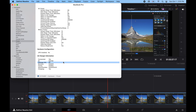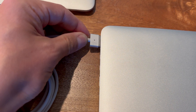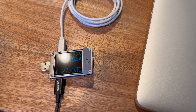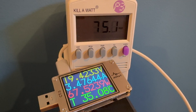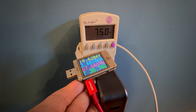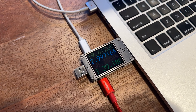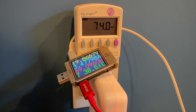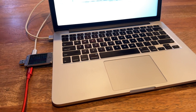The cable lists itself as a 60-watt power cable, and I had some questions about USB power negotiation. My first test was with the 140-watt Ugreen Nexode and a kilowatt electrical usage monitor alongside an AV-HZ-Y CT3 multimeter. The kilowatt reports 75 watts and the CT3 reports 67. The discrepancy is largely caused by the gallium nitride charger being far from 100% efficient, with cable losses and CT3 consumption accounting for the rest. This was very similar to the Apple 96-watt supply, which drew 74 watts from the wall and output 67. So far, no surprises — the cable didn't get hot or catch fire.